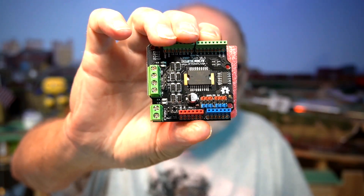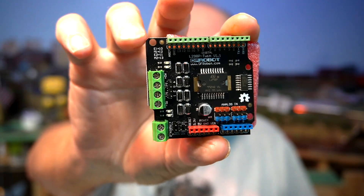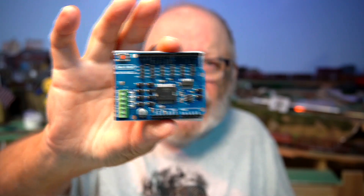I'm going to show you the DF Robot right here. The pins on here are a little bit different, and you can see them right up here in this corner — they're marked showing which pins go for the motor and which ones are for the brake. Not all of them have the same designation; they might have it written on the board, or if not, you'll have to check the documentation for your motor shield — you can usually find it by Googling it. Your best bet is the Deek Robot motor shield — you can get them anywhere: eBay, AliExpress, even Amazon. They're very inexpensive and they work well for the tortoise machines, and they also work on DCC++.